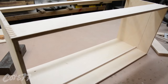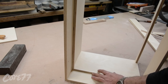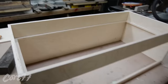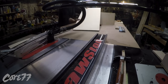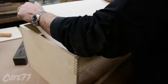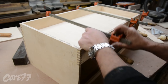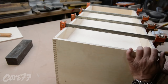That's a little marking gauge I'm using so I can set what's going to hold the top tray up. I make a lot of these little marking gauges just so I have a consistent line. Here I am cutting that piece of wood, gluing it into place, and clamping it. I have a habit of gluing things together and letting them dry, and then I put screws or nails into it — it keeps things from shifting around while I'm trying to screw or nail it.